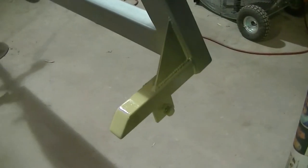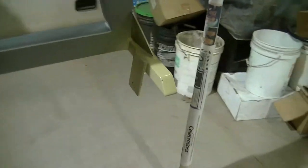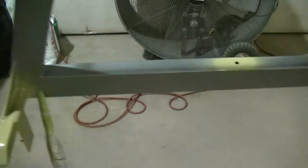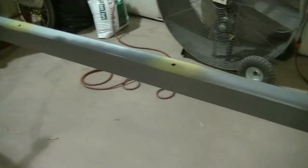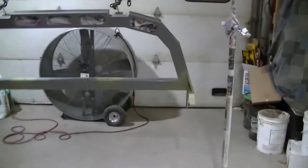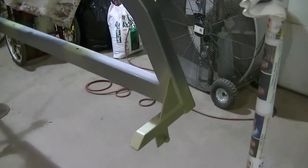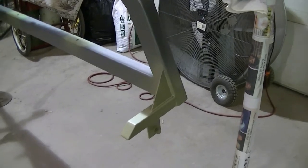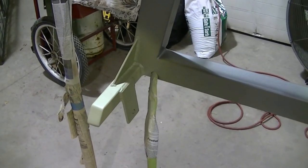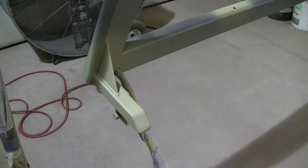Okay, I'm going to take a break, let this flash 30 minutes, and put another coat on. I may put three coats on — we'll see. Okay, got it all primed. I did put three coats on here. I went with three because I'm going to do a little bit of sanding on it.